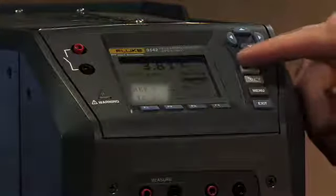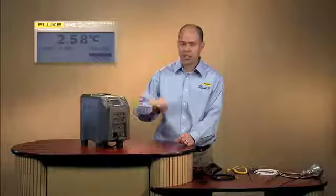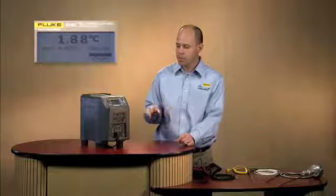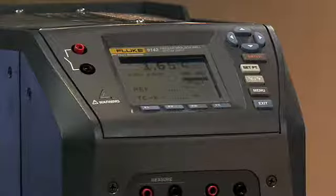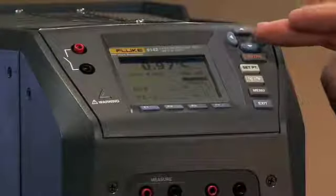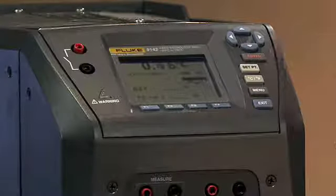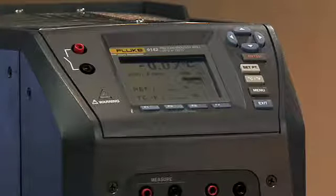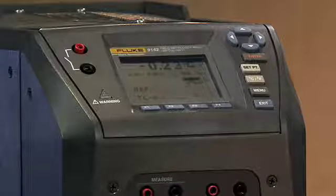Right down below that, you'll see we have ref and then TCK. Now that will only appear there if you have the process electronics. That's the ability here in this case that you're reading a reference probe or a thermocouple, which I'm going to show you here in a minute. And so that's kind of an introduction to the screen. You have your basic block temperature, your set point temperature with some information about the power, percent heat, percent cool, stability indicator, and then your reference temperature and the unit under test temperature for your process electronics option.